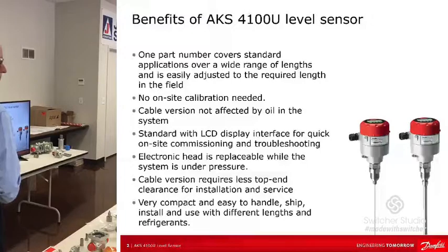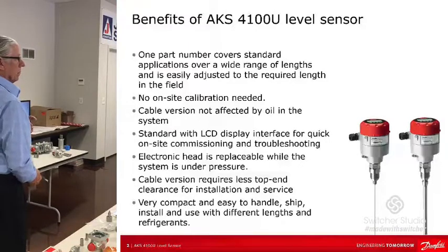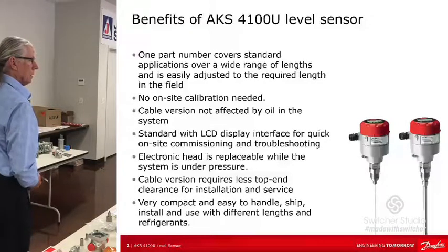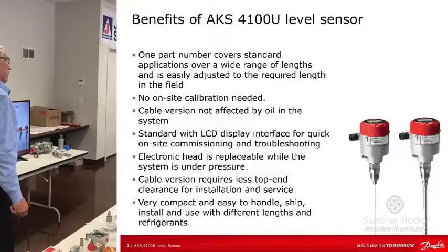Do these have standalone controllers? I may be jumping the gun here, but this particular one, we have a standalone controller, but typically the signal is going to a PLC in most factories that I go into. I just wondered, like it had standalone control, it had maybe 2 or 3 outputs on it. For alarms and stuff, or? Just for anything. Yeah, level, control, anything. Yeah, exactly, and digital outputs, you're gonna glaze over that one too. All right, sorry. No, it's fine, yeah, that's our EKE 347. The most common thing though that we see is a PLC.